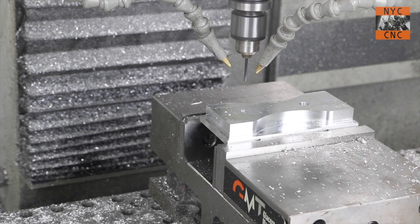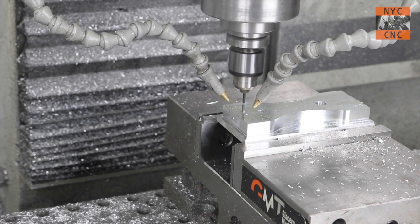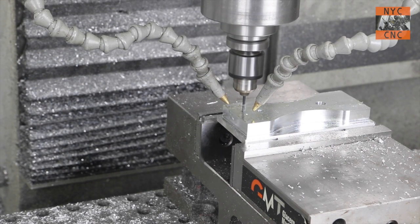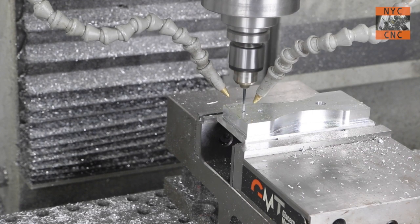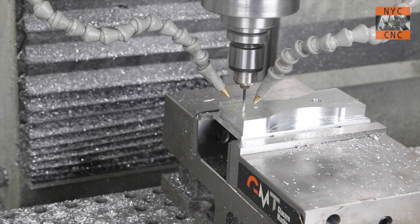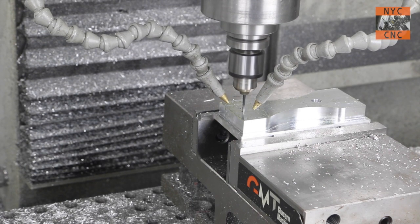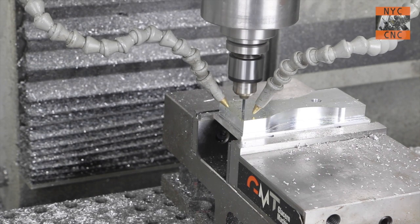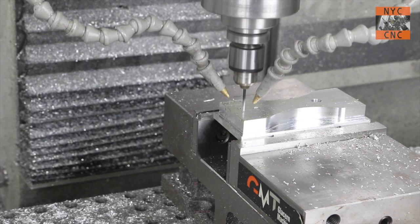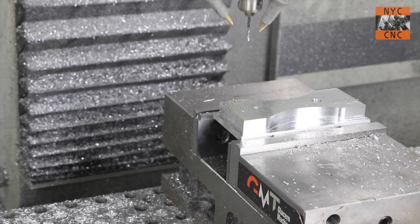I wanted to mention the roughing end mill we used, and then actually that number 32 tool as well. That roughing end mill is a great example of a difference I found between beginner machinists and intermediate machinists, which is when you're using a tool a lot and you don't need to have a sharp corner, switch to a radius corner end mill, because not having that really sharp point, that's by far the weakest point of an end mill, the most likely to chip. And when you don't need it, you can get a much better tool life out of an end mill that has a corner radius.